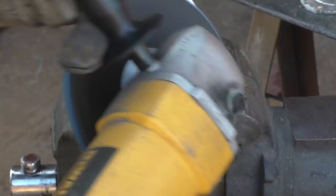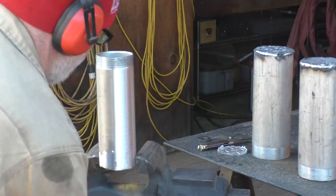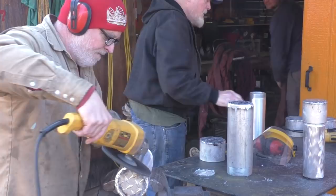I often hear that old saying - a grinder and paint will make a welder what he ain't. All those things are true, but the truth is I've rarely seen a weld I can't make look better with a grinder. Unless you're one of those anal, very slow TIG welders, I can make it look better with a grinder. This is just showing off - done with a MIG, very carefully, one tack at a time all the way around. It looks like TIG.